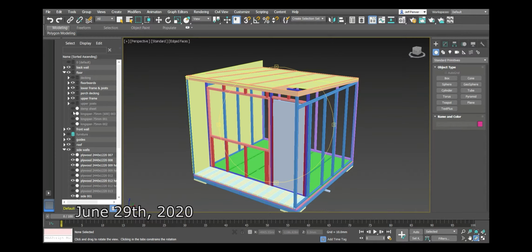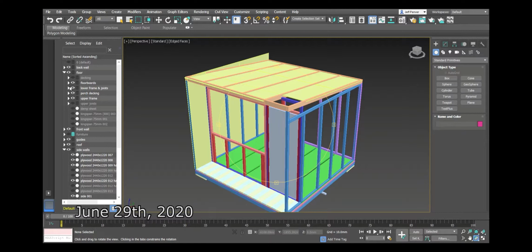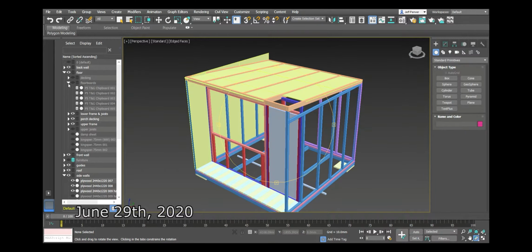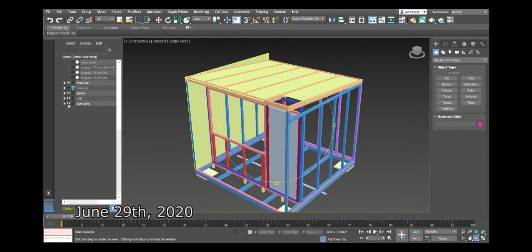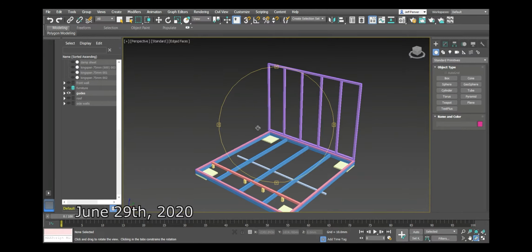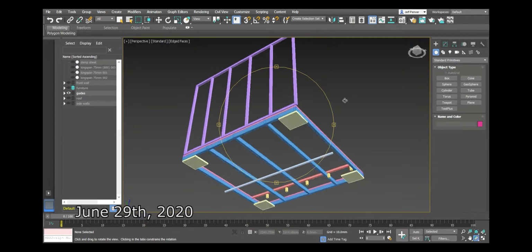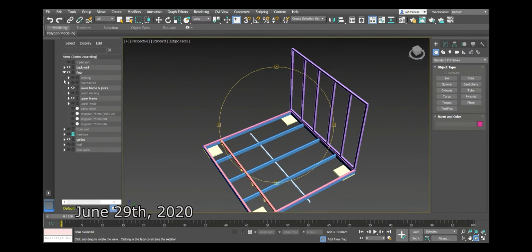To create the design of the new summer house, I drew it all in 3D Studio Max. It's not an entirely accurate render, but I've used real scale dimensions to create all of the structure of the summer house. What this gives me is an idea of the quantity of the materials I needed, and I was able to add more detail as I needed it for things like the decking planks and the flooring, the number of sheets I needed in the roofing, and how the window will fit within the front wall, etc. It's not the easiest way to do it, but it does give me a parts list and helps me create the online order I needed for all the timber.